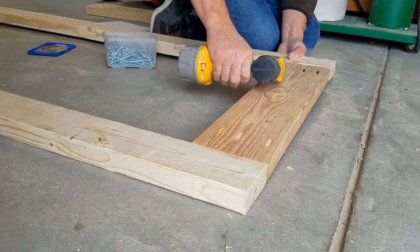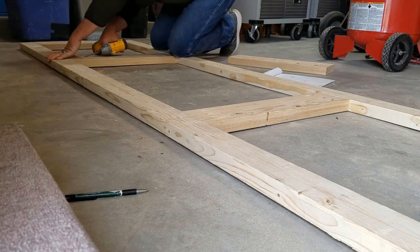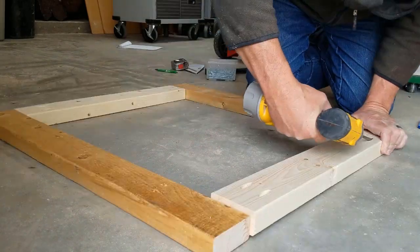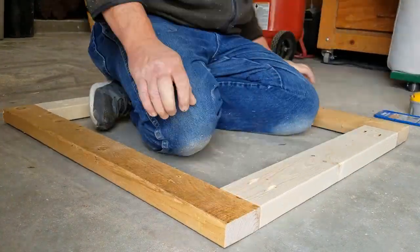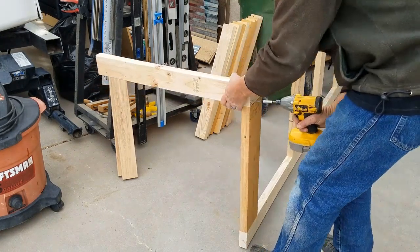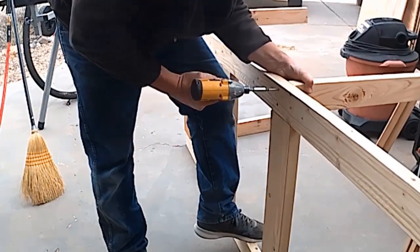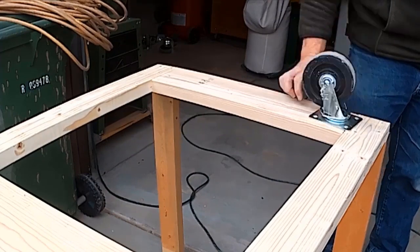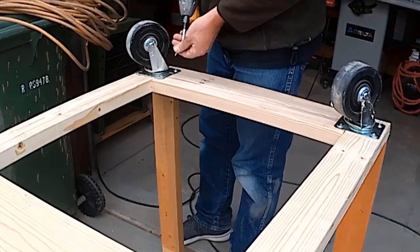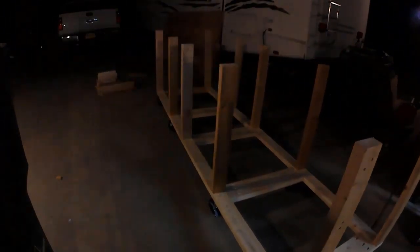I used pocket holes to put together the base of the frame. This is what the cabinets are going to sit on and will become the base for the entire miter cabinet. Then we'll get the top frames for each of the two sides that go above the cabinets. The tricky part is pre-drilling and putting in the screws that hold the sides of the cabinet. Once I get all the legs attached, we'll flip it over, take the wheels off the existing cabinets from the garage, and put the wheels on the entire bottom of the new frame. We'll roll it inside and see how the cabinets fit.